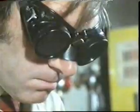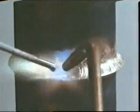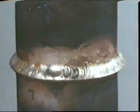Once the temperature is reached, the filler rod is applied. It melts and flows over the surfaces of the joint. As it does so, the filler material intermingles with the copper surfaces and a thin layer of alloy is formed. This produces a strong bond. The rest of the filler material reinforces the joint. Can you think of any jobs where braze welding might be required?